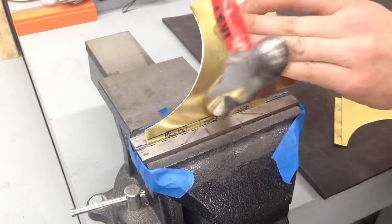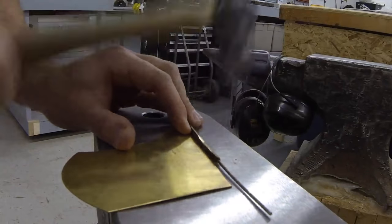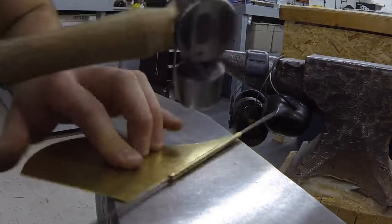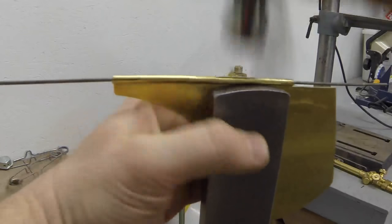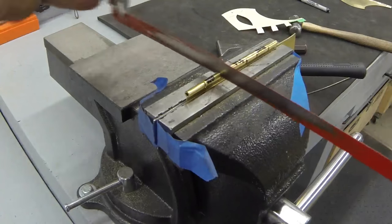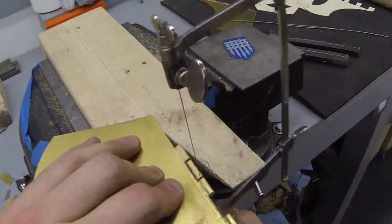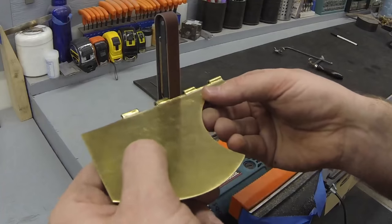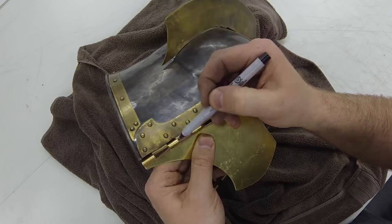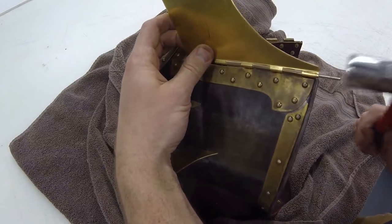For this faceplate I decided that I would hand roll the hinges. It's a process that takes a little bit of getting used to but it's not actually that difficult — it's about the same amount of work as doing it on the bead roller and a lot more satisfying. I'm using a piece of wire that I will use as the finished hinge pin, and a variety of different holding techniques to just get that shape right. Using a hacksaw I cut the hinges, always a little bit shy of where they should be so that we can do fine tuning with the file. Using a jewelry saw finishes those off, then mounted in my vise with my favourite power file. Getting this exactly right is a little bit tricky — there's a lot of back and forth with a file and marking and filing. I put a piece of tape on my file to protect surfaces that I don't want to file. Now it's finally all fit and it's nice and snug.